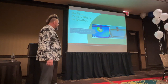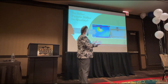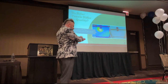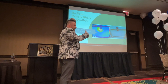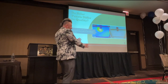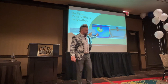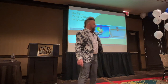So that's also the back of the panel. That's the front of the panel. Yeah, it's the back. I won't get too deep into thermal imaging, but if I'm thermal imaging the front of a solar panel, I'm looking down on the glass. When the sun hits the glass and it reaches our eye, you don't just see a circle, do you? You see the sun and the light spreads out across that panel. So your gun is going to see the same thing as well. It's going to see the heat, usually in circular form, which is why, when you see the clouds and the rain on the weather, it's not a circle, it's a swirl. Well, you get the same effect when you thermal image it. However, there's no glass on the back of the panels. So when you thermal image the back of the panel, you'll get a clear indicator of what is going on there. You have one faulty cell on there that's overheating.